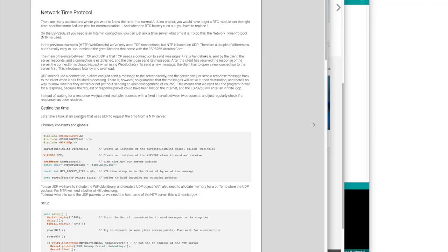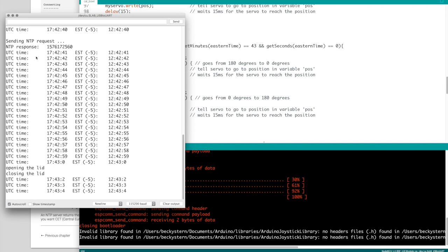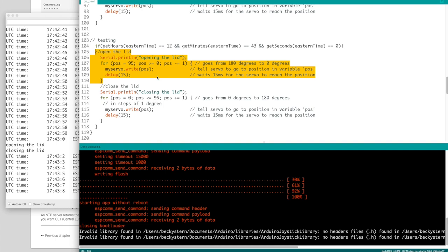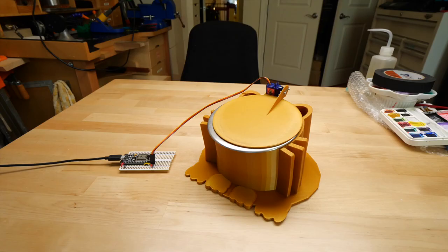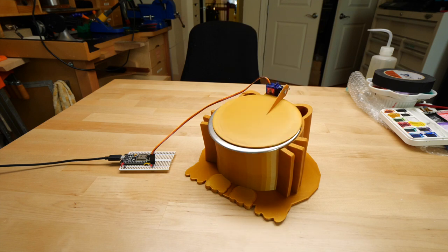The Arduino sketch joins your Wi-Fi network and uses network time protocol to fetch the current time, then opens or closes the lid according to a hard-coded schedule. Copy the code you can find at the link in the description, update your Wi-Fi credentials and UTC time offset, I'm in the Eastern time zone, and upload it to your NodeMCU board using the Arduino IDE.